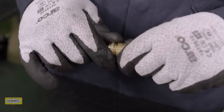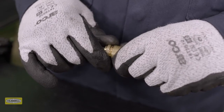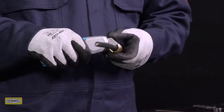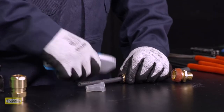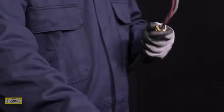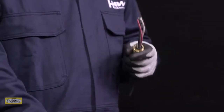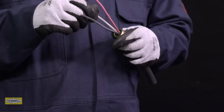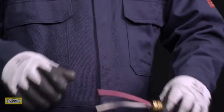If it isn't satisfactory, repeat the previous step. Take the inner sheath back to between flush and three millimeters from the end of the spigot. Remove any fillers, plastic, or coatings present in the cable. If required, prepare any drain wires or screens as per assembly instructions 2028.